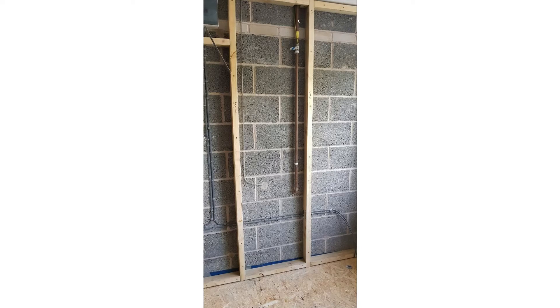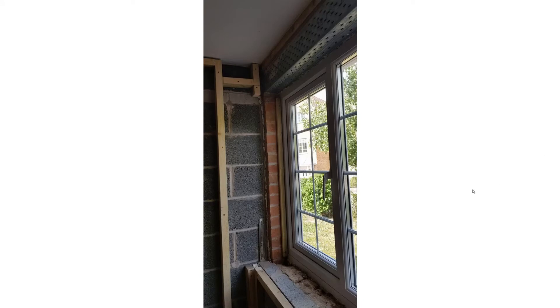There's a gas pipe coming through — the gas box is on the other side of the wall. Here near the window I'm putting some battens and things in, with a piece of wood screwed to the wall for the plasterboard to sit on. The depth of the insulation at this location is set by the distance from the front face of this to the wall — I wanted to plasterboard directly up to the window.